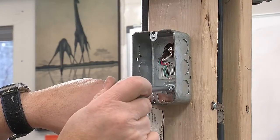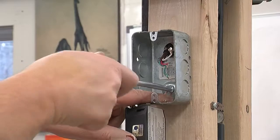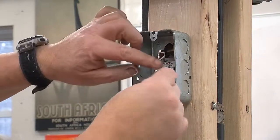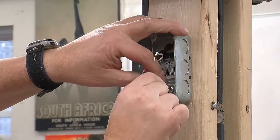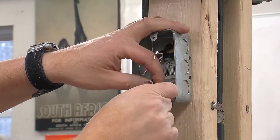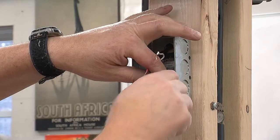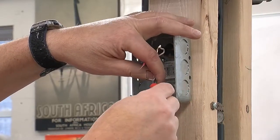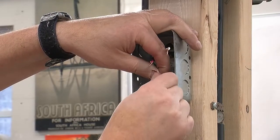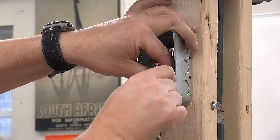And we'll just tighten it in nicely. The utility box is now grounded. If you have something that's exposed metal, it's not just a good thing, it really should be grounded, just to make sure that if anything were to go wrong, there's at least one level of protection. So we'll use a MAR connector to connect these together, like that. And that's the ground.